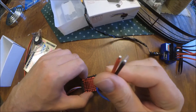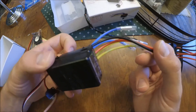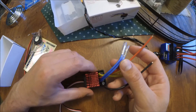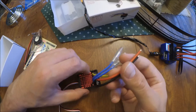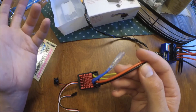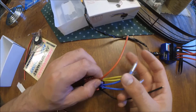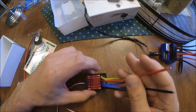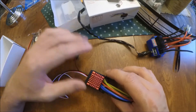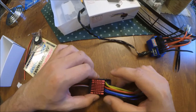With this one, all you have to do is put a single 4S input in and it can handle 4S just like the stock one. You just have to buy or make a series adapter for your two batteries, and then if you want a 4S input for anything else you just tap it off here and you're good. It's super cheap — I'll include a link, it's probably cheaper than the stock one — and with the little switch, single 4S input, and same ratings, it's pretty much a no-brainer.